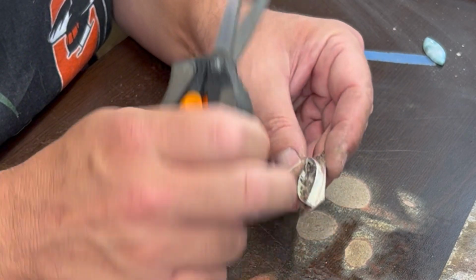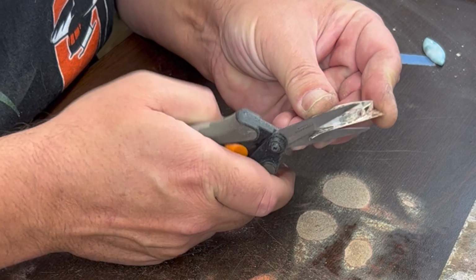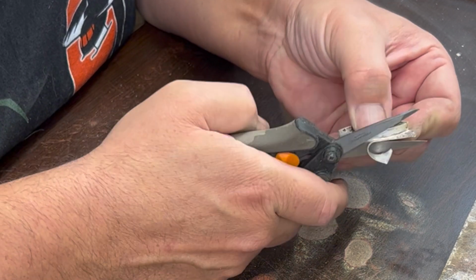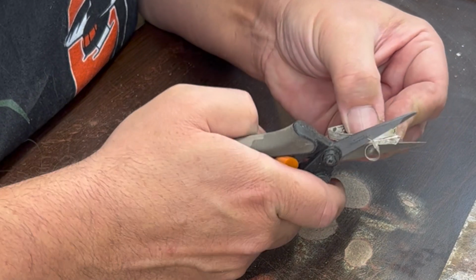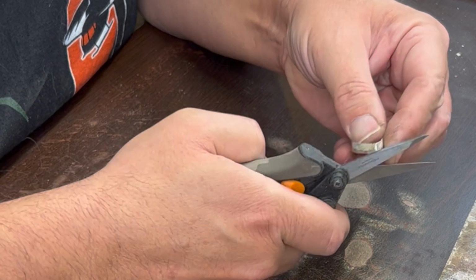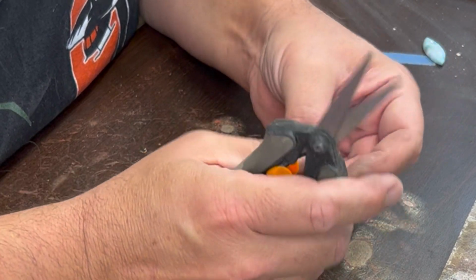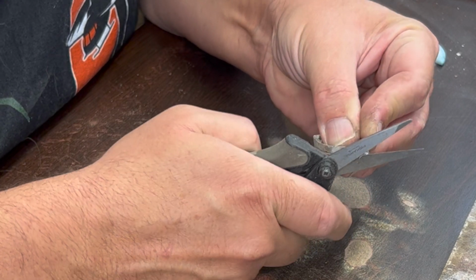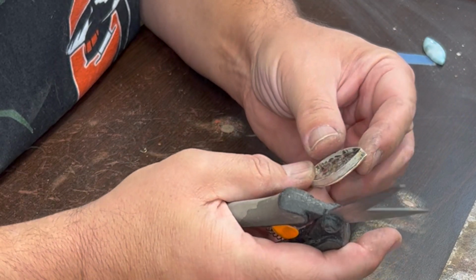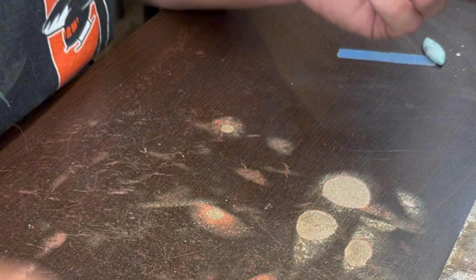On the base, before you do it, make sure you got a good seam all the way around. That's always a good thing to check. If you don't, you can always go back and add a little solder. A good rule of thumb is if you're soldering something and something is going sideways in a way that you didn't expect, back the heat off, stop, and think about what's going on and see if you can figure out why that was happening. Generally, soldering problems have to do with not heating things in a way such that they all reach temperature at about the same time, which is kind of important when you're trying to solder two things together.